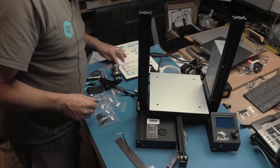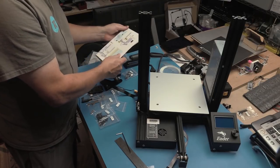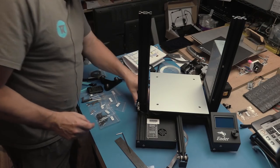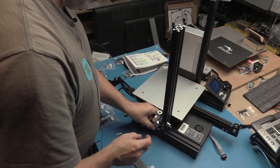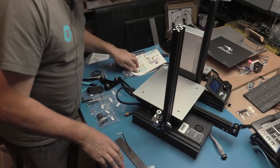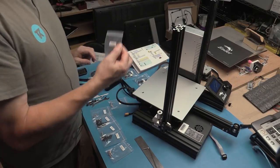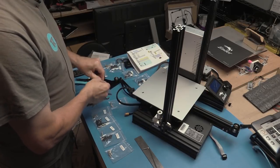Step four is putting in the Z motor. That is going to go right here. If I rotate that round a bit, that's going to go right here. It's got two holes here. We need M4 by, says 18. Oh, there we go. They're hidden. Hidden under my remote. You do have them. I knew I must have counted correctly because I thought we had everything.